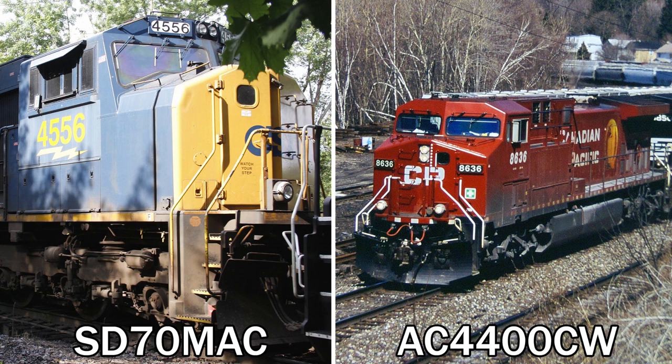GE, on the other hand, uses separate AC motors that supply cooling air to the traction motors regardless of the throttle setting, which is one reason why GE units have a higher tractive effort and amperage limit than EMD models. The argument could be that although the continuous ratings of the motors require a given amount of motor cooling air, the locomotive will be operating in notch 8 whenever the rating is critical to getting a train over the railroad. EMD probably designed the blowers to provide the required amount of air for that operation, so the fact that the blowers are mechanically driven rather than electrically could be called immaterial.